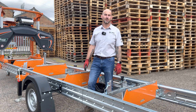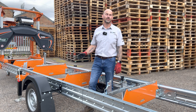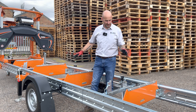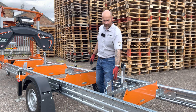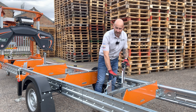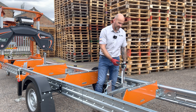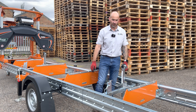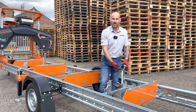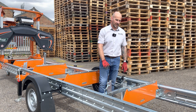The standard length of the bed on the HD38 is 20 foot or 6 meters, and that allows you to mill a 17-foot log or 5.18 meters — you always lose that three foot due to the carriage. Also as standard you get two log rests and two log dogs. Log rests are fully adjustable for squareness of the cant of wood. It also comes with a serrated section that bites into your log to start with, and then this can be flipped back out of the way so you're left with a nice smooth edge that won't mark the wood. The scale on here represents how many inches away from the blade the log rest is, so the lowest cut you can make on this bed is one inch.